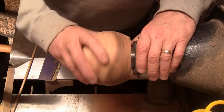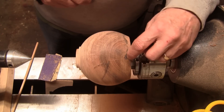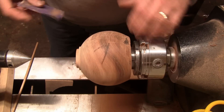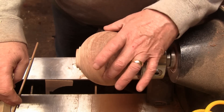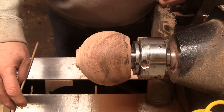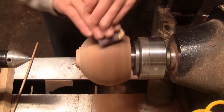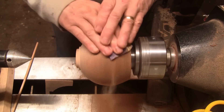I'm ready to sand this. Last night I put some brown Star Bond in this cracked area and a little area that didn't go very deep — I just wanted to fill it. I'll start with 80 grit with the lathe running in reverse at about 500 RPM because it's a small diameter, and I'll get it sanded up to probably 400. I'm just using sheets of paper here because it's pretty small and easy to keep the shape.